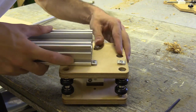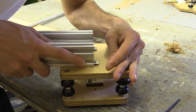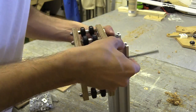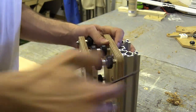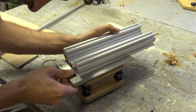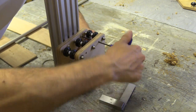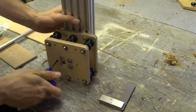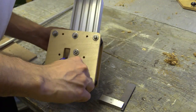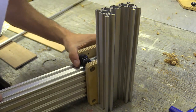I'm now at a stage where I can start assembling the X and Y axis of the machine, but I want to try think ahead and avoid dismantling the machine at future stages if I can help it. So the first thing I'm going to do is fit the Z-axis C-beam to the gantry plates. I haven't finalised the plates for this part, which is what I'll be working on in the next video. This machine will use 3 500mm 20x40 aluminium extrusions, 3 500mm C-beams and 1 250mm C-beam. I decided to make a smaller machine first as I don't want to start cannibalizing the X-carve and realise I still need it to cut parts out.